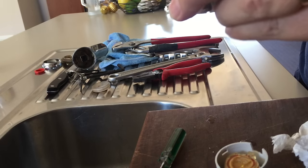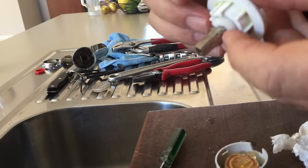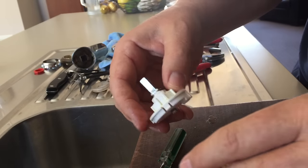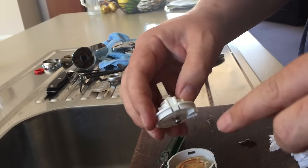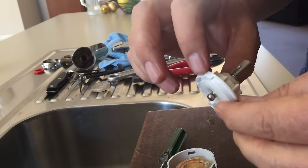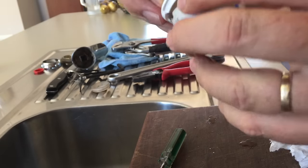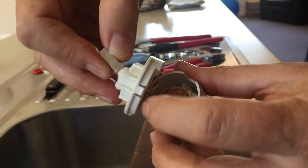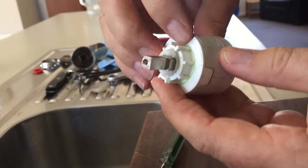It was the up-and-down movement that was causing the rough feeling. Now putting this back on — there's a big hole at the front which lines up with this, clips at the side, and a little thing at the back. It's pretty hard to get it on incorrectly — or it won't go on incorrectly — so you need to line up that little stainless steel ball so it drops in there.